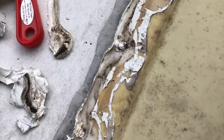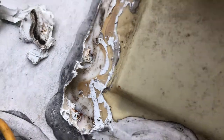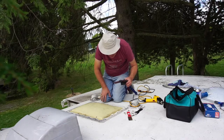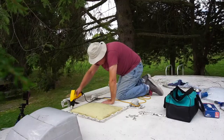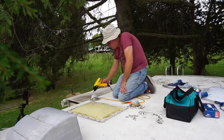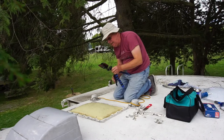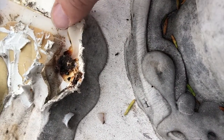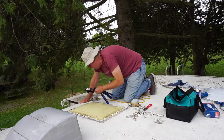As you can see there has been some water incursion under here. You can tell by this dirt — over the years it has not been perfectly sealed, and in fact we did find a little bit of a water leak in our bedroom, which is what drew our attention to this skylight in the first place. I was up here re-sealing it when I decided it really needed to be replaced. Right in here, when they installed this skylight, they screwed down the screws too deep and hard and they cracked it — at least in part why there was water incursion into the bedroom ceiling.